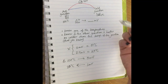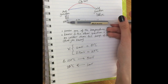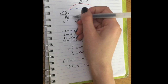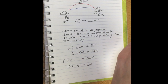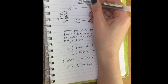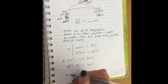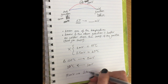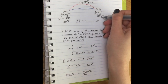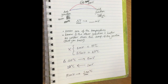Say you're trying to find the temperature of an oven that's higher than 100°C. You remove the steam junction and place the thermocouple in the oven, and now you get a new reading of 10 millivolts. Using your calibration, 10 millivolts corresponds to a 200°C change, and since it's 200°C above the 0°C cold junction, the oven temperature is 200°C.